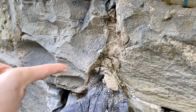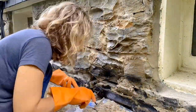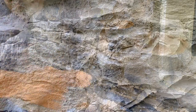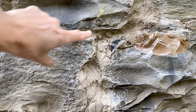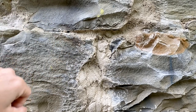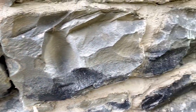The idea here is to completely pack these joints and get to the point where I just have to tool the outside. At this stage it really doesn't matter what things look like — I've got lots of little tool marks and it looks kind of globby and all over the place. I haven't even started tooling it yet. At this point I'm just filling the voids; there's nothing super special about the way I'm packing all of these voids between the stones.